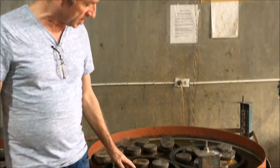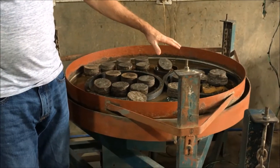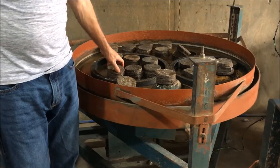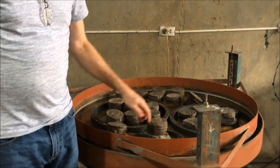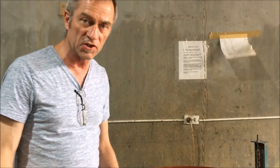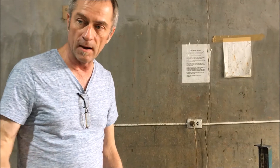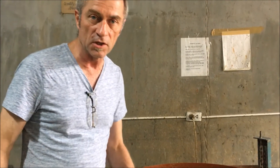When we're running, we cut PVC rings to separate the stones so they don't bang against each other. We use just a steel weight — we use hot melt glue and glue the weights on it to keep pressure down on the stone, and the grinding cycles pretty fast. We're running six machines in here right now, and we can cycle a couple of loads all the way through on all six machines each week.